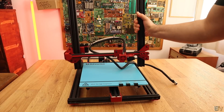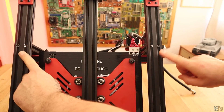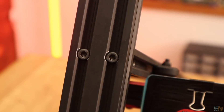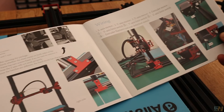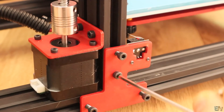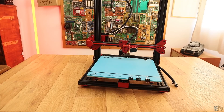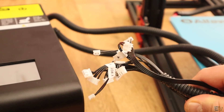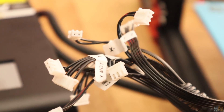As with the Creality CR10, all we have to do is put the top part on top of the bottom part and, using just 4 screws, join these parts together. You also have these steps in the provided manual. After that we add the metal brackets on each side, tie the screws, and the body of the printer is ready in just a minute since it arrives almost 100% pre-assembled. Now that the frame is ready, the next part is to take the electronics case and plug all the motors and end stop switches — each cable has labels so you can't get them wrong.